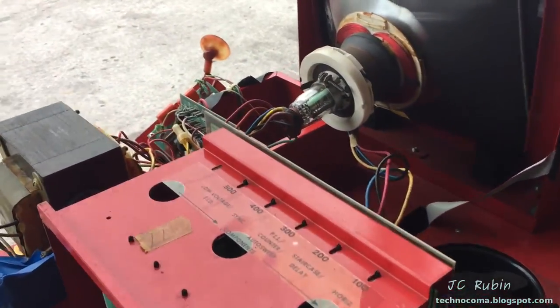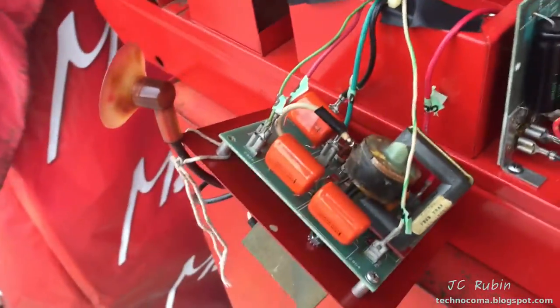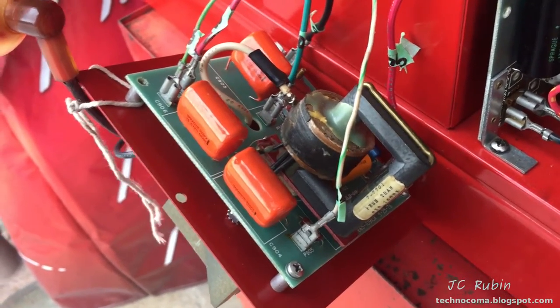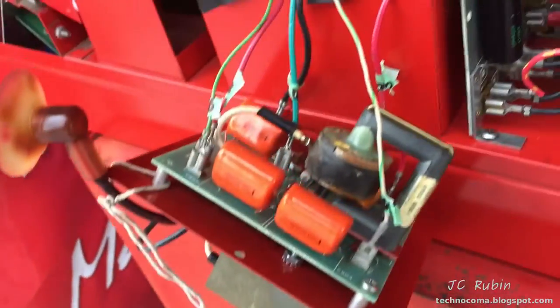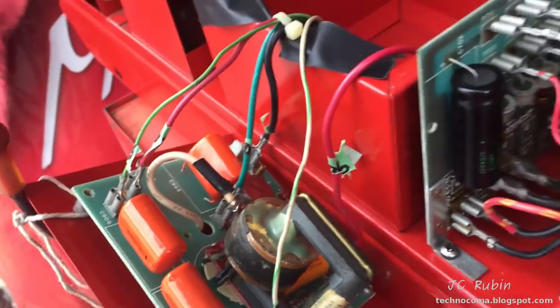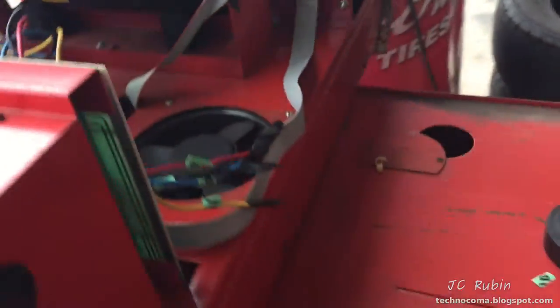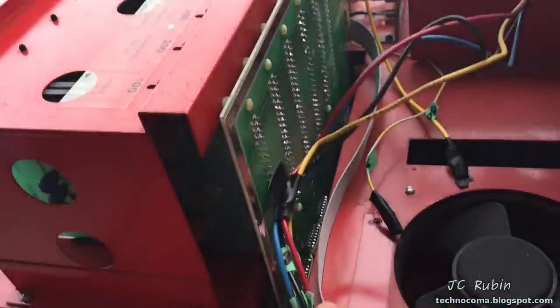First of all, I have reintroduced the high voltage circuit for testing purposes, and I've done it in a relatively safe manner. I've tied in all the connections but flipped it over far enough away so we have exposure to the flyback transformer, and the very high voltage on the doubler or tripler is sitting here hanging free but tied off — so it's not going to arc to the cart or any of us. I did not reintroduce the horizontal/vertical driver, but I have taped off all the top and bottom wires and will obviously have them out of the way before I spin up the fan.